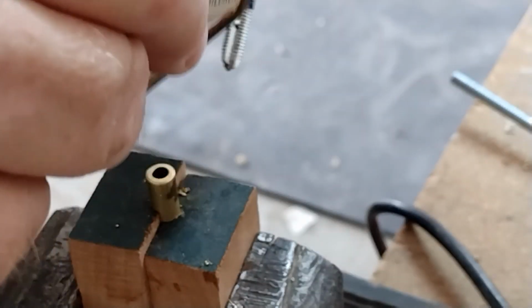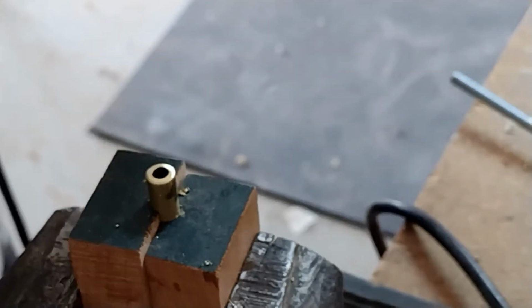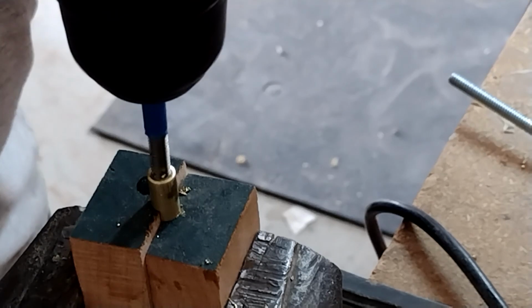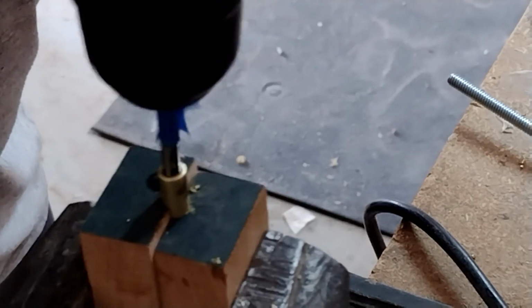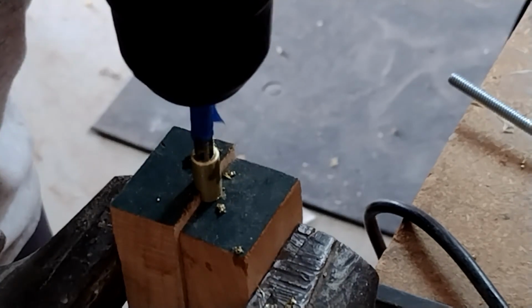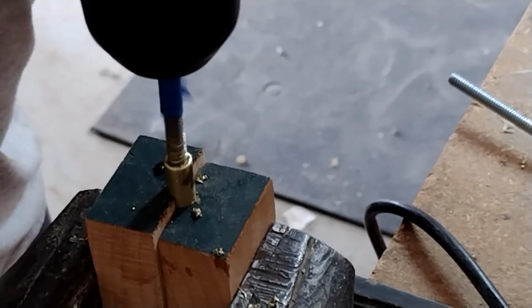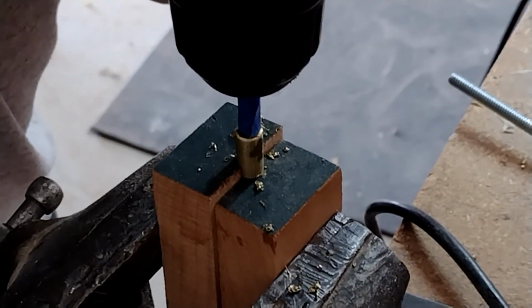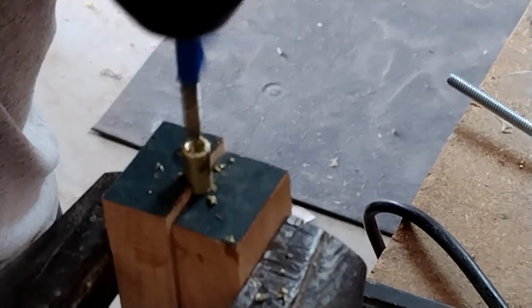That actually works great. I'll put some oil on this. It's not officially cutting oil, but it's pretty close to that. Using the same tap I used previously, and it works okay. It's getting a little bit older and a little bit duller, but it does great until it breaks a little later. Of course, you drill 20 taps, 22 technically, because I was doing an extra lug, and it breaks on the 18th one. So I was almost done.